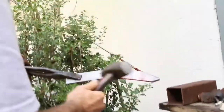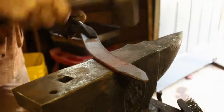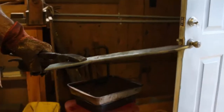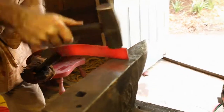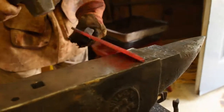We're giving it a reverse bend. This is the blade side — it allows me to draw it out. You will see it begin to straighten. Now I want to flip it over and get that tang hot, so I just want to start getting that formed out here.